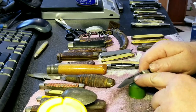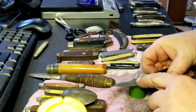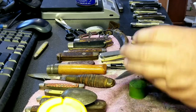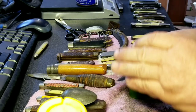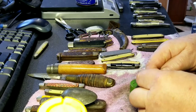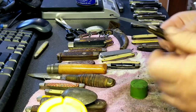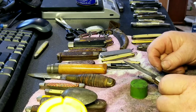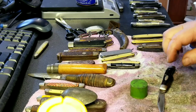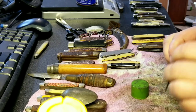Now cleaning the knife — I don't know if you can see all the little marks that are still on there. You never actually take out a scratch — you don't sand out a scratch. What you actually do is sand the surrounding material away down to the level of the scratch, so you're doing quite a bit of harm to the thing. You'll see a guy go up to a belt sander, clean up both sides, make it look nice. If you have the talent and the touch, that's probably not a bad way to do it. But if you don't, you're going to take off a whole lot more material than you want.